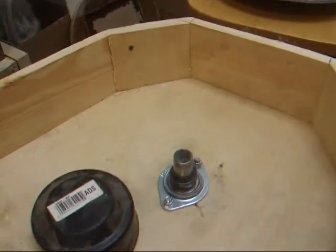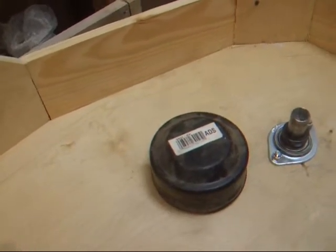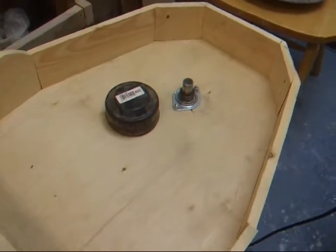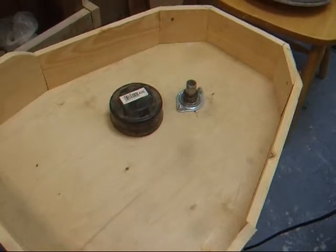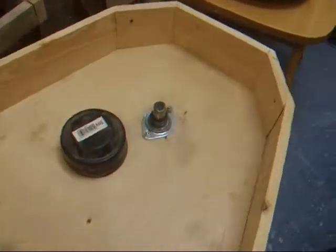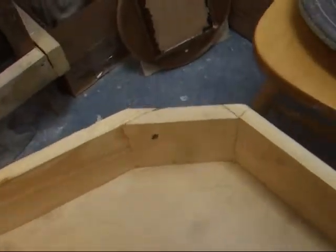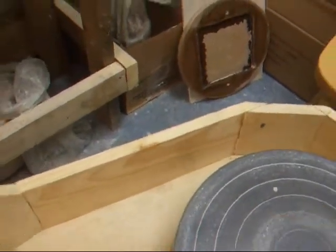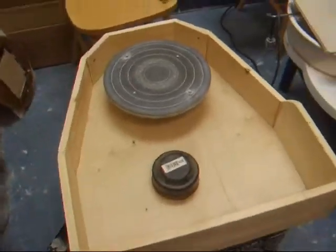What I'm going to do is finish screwing this thing together, then coat it with boat-building epoxy — a two-part brushable epoxy. I'm just going to coat it inside and out and maybe paint the outside. It's going to be nice because it's a one-piece wheel box with no splash pan. Of course the throwing head goes on, so it should be pretty cool. I'm pretty happy with it, actually.